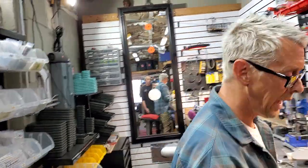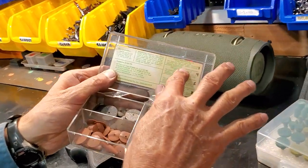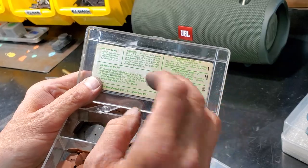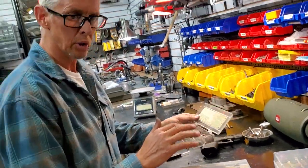So Cratex will say, use this wheel. I don't know if it's in here. Yeah, they have it in here. They talk all about the grit size, 2,500 RPM, 30 to 80% of max. So this has to be understood when you're using this.